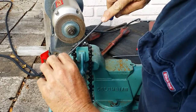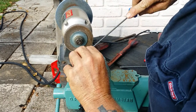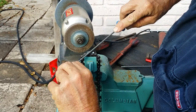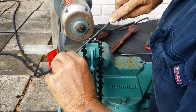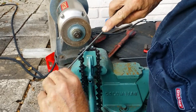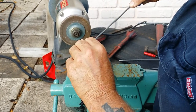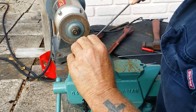What I'm going to do is just come down like this with it, trying to just push it in and up at the same time. Tap the file a little bit. You can see the tooth slowly starts taking shape. You've got to stay in control of the file — you manhandle it a little bit. Let the file know who's in charge, otherwise you'll be all over the place with it.